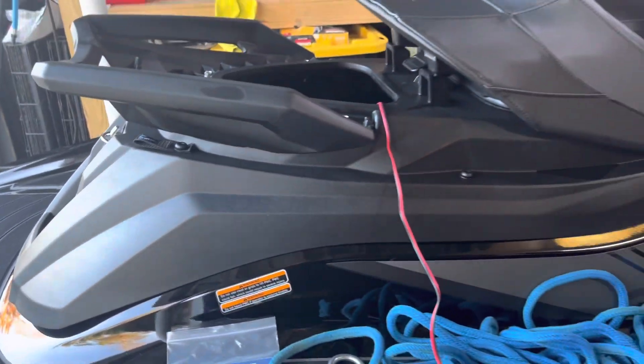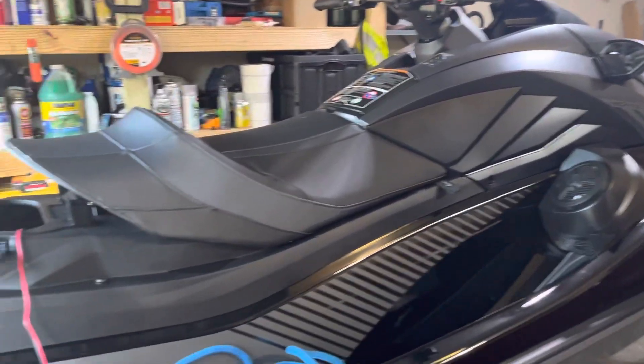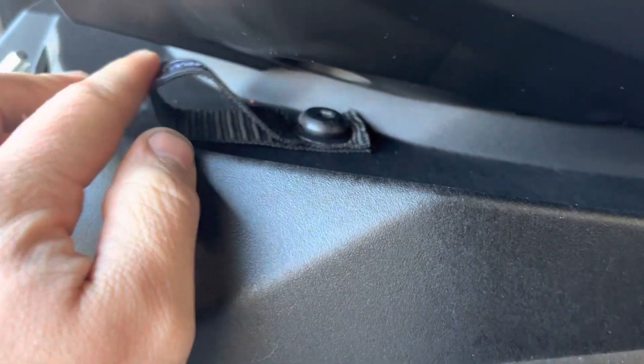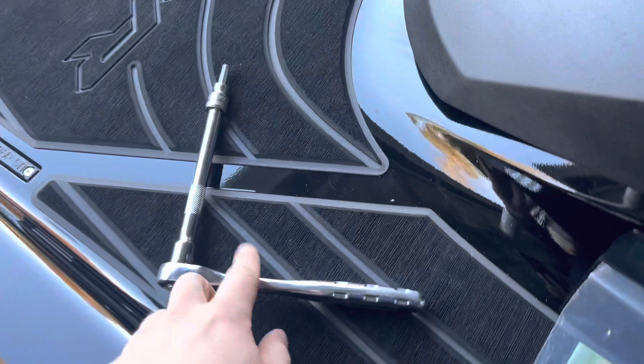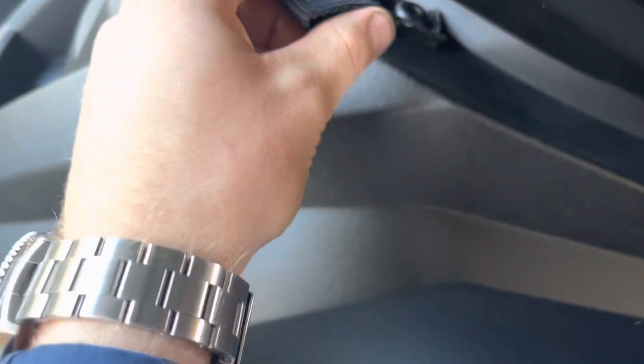This is the first time I've done it on a newer style VX or GP. The best place I've found — and I'm going to give this a test — is the back of where the plastic seat bracket thing is mounted. I added one here and another one on the other side. All I needed was a six millimeter allen with an extension — you go through the top, take the bolt out, push the bolt through the hole, put that there, and torque it down.